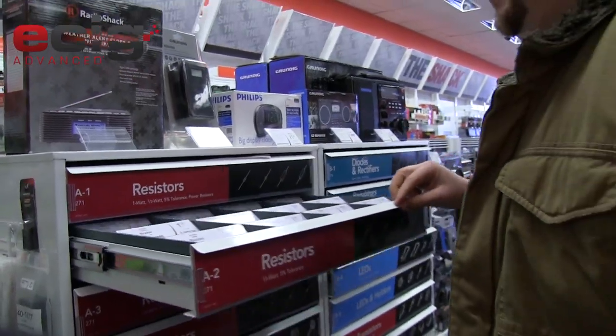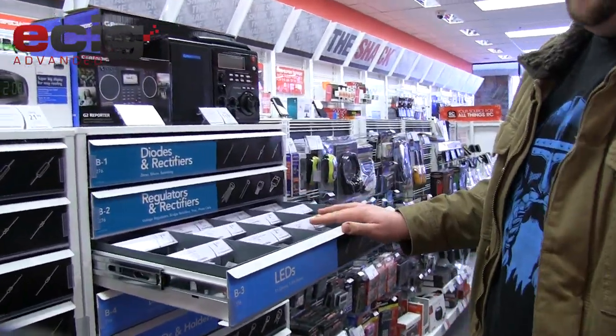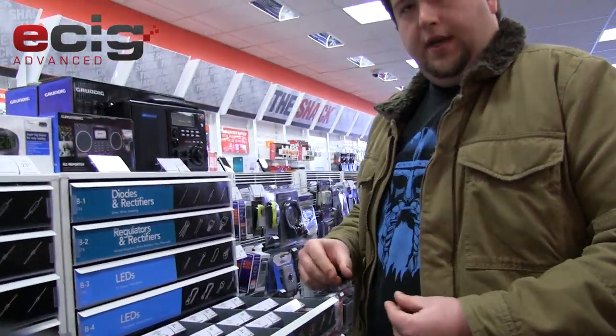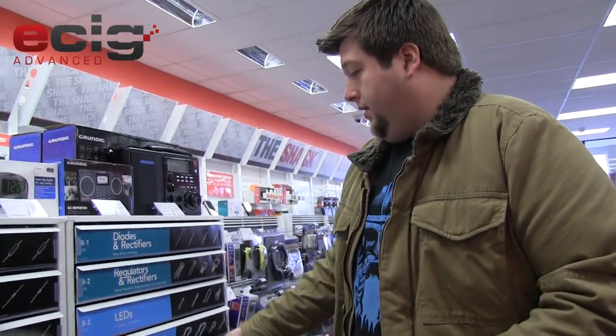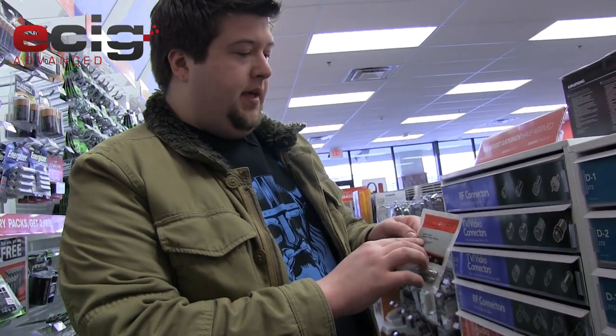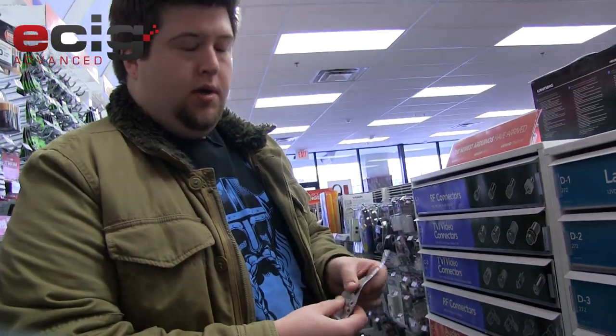Your resistors - the kind we're going to get is the 470 ohm, half watt, about a dollar 19 for a package of five. If you want to do LEDs, there's an LED section you can open up and pick any type of LED you want - they have multiple colors. They also have little holders for the LEDs. The last thing you'd need is a 510 connection, unfortunately they don't have those here - you'll have to sacrifice a device or order some online. If you want to use a 901 connection you can get that here. Also pick up some solder-type phono plugs while you're here.